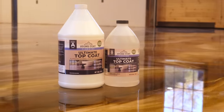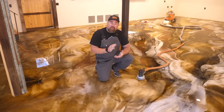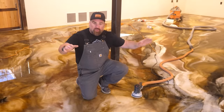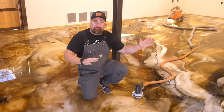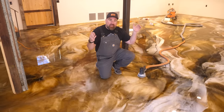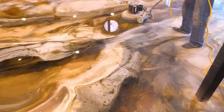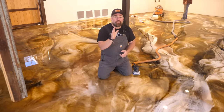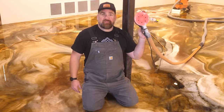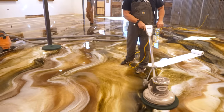It's cold here in Oregon — it is the very end of October, winter has arrived, and it's been in the 30s. We had to let this floor cure overnight, which is totally acceptable and normal in colder temperatures. We could have proceeded to the next step if the temperature stayed above 50, but it got really cold, especially by the doors with cold air blowing under the barn doors, keeping the epoxy a little too fresh. It's a pro tip to press pause and make sure the floor is ready for the next step — give it a couple extra days in colder months. Since we're past the 24-hour open window, I rented a floor buffer for $30 at Home Depot and with a maroon Scotch-Brite pad, it'll take me maybe a half hour to rough up this floor. Then we'll vacuum the dust and apply the Ultimate Top Coat.